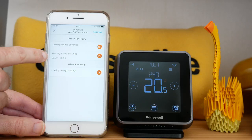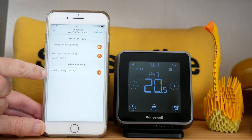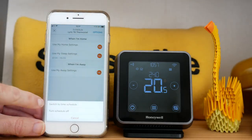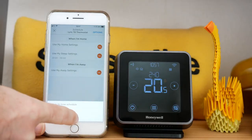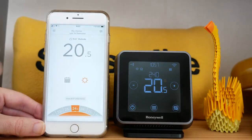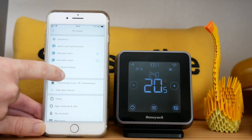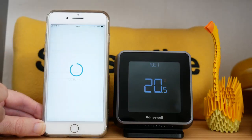To reset the Lyric T-Family thermostat: Step 1 — select the menu option on the home screen. Step 2 — click the arrow button until you see the reset option on the screen. Step 3 — once the reset option is visible, click on select. Step 4 — use the arrow keys to hover over to the reset options. Step 5 — select one of the reset options and click select. Step 6 — click on yes to reset the thermostat. Step 7 — if you select no, you will go back to the main menu. Your thermostat is now reset to default and you can configure it again.